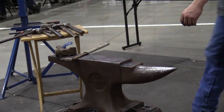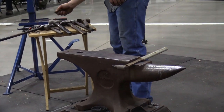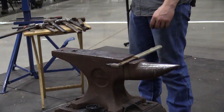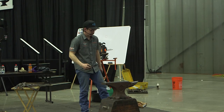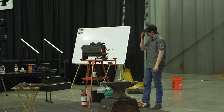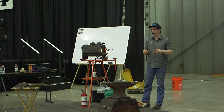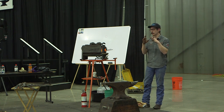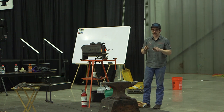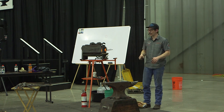At home, when I do the rivet hole, if I'm going to do it the preferred way, I use a smaller punch and just get a hole started, and then I come through with the drill and drill the hole out, because then it's a perfect hole. It doesn't have an hourglass to it. It just has two straight sides, so they ride well together around the rivet, and the rivet lasts longer because it has a supporting collar all the way around it. I do have sets of tongs that have hourglass eyes on purpose. Those tongs kind of sit all around the rivet, for shoes like roadsters and wedges and things like that. You'll sit on the shoe a little better and walk up better.